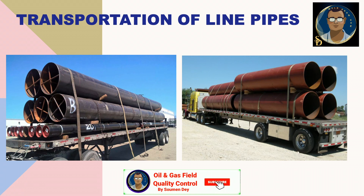During transportation of uncoated pipe — you can see the photo at the left — the pipes are tied together, especially for big-bore pipes, to keep pipe ovality to a minimum. Sometimes we need to put cross supports at both ends. End protectors are sometimes necessary, sometimes not, based on the scope of work. Iron chains are prohibited if we transport externally coated pipes. If pipes are internally coated, end caps are mandatory to protect the internal coating. Externally coated FBE pipes are segregated using wooden skids in between, or rubber tires or rubber padding, and the whole load on the trailer is wound up with nylon slings.